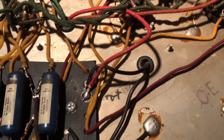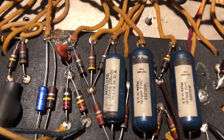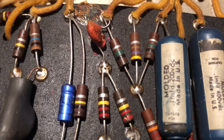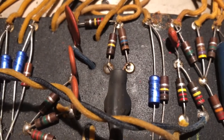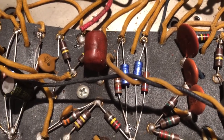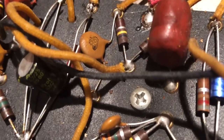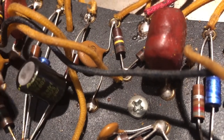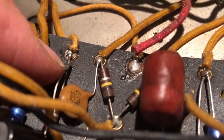He also left the receptacle in the circuit — I will remove that too. Look at this disk capacitor: this poor sucker spilled out its guts. The bypass capacitors — the blue ones — are changed out, but with the wrong value: 47 microfarad instead of 25. And here's a fun one — there's one capacitor just flipping in the breeze, not properly joined either.